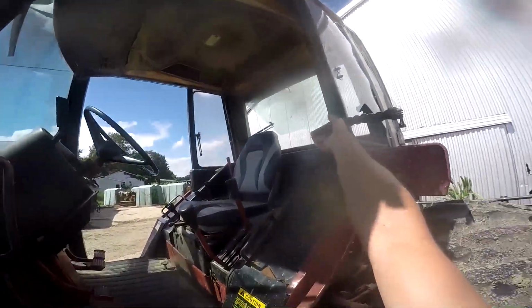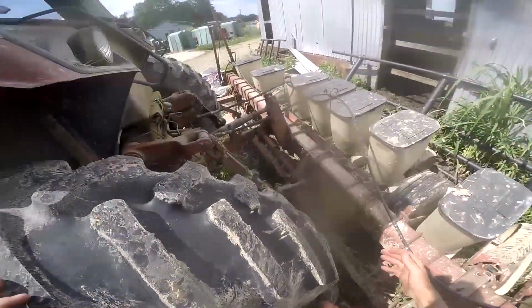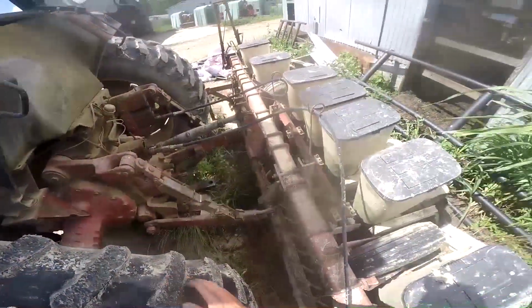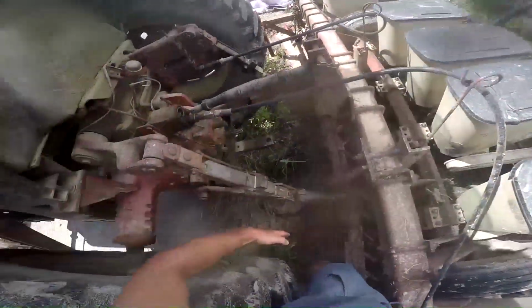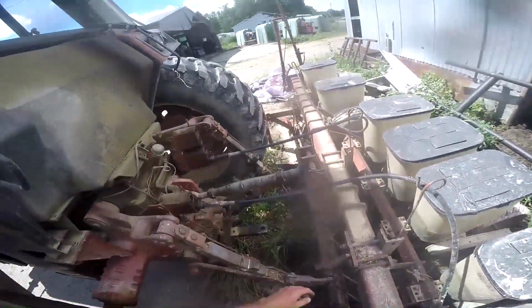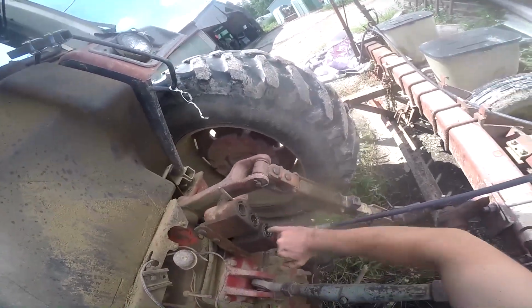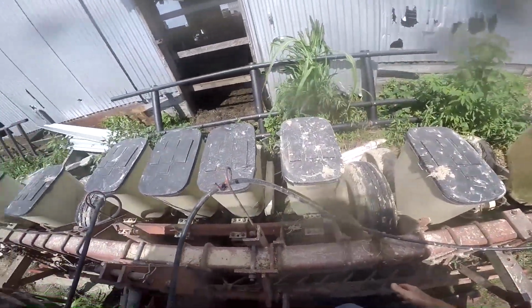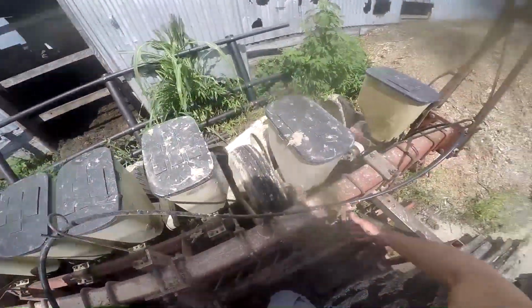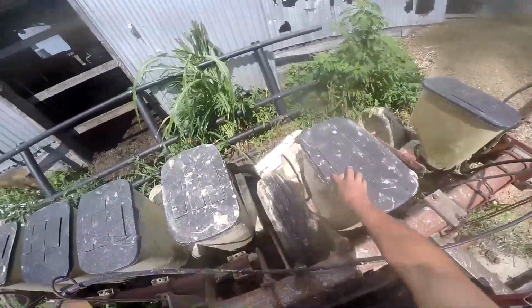But for the replant, I put them on the 10 because I haven't had time yet to adjust the tire width. And the 2+2's tires are set in narrower, so this row was half being planted in the tire track. That's not the case at the 10. We set this planter up for the 10 because a couple years ago we changed spacing a little bit to make sure it tightly fit. And we moved these rows closer to the tire track.